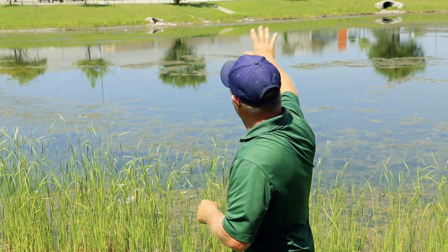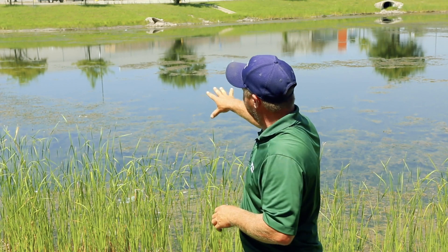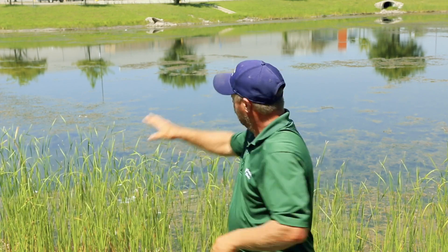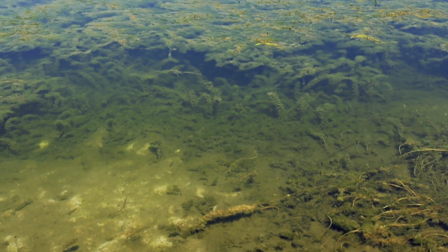Today we're at the PTI farm and we're irrigating some of our crops here at the research farm. One of the things we're doing is we're using Netafim drip tape, but our water source is a reservoir. This is one of two reservoirs we're using on the farm — an additional reservoir we're pulling water from — and one of the issues we've got is water quality. We've got a problem with algae and what I call seaweed growing from the bottom. We're getting too much sunlight in, getting some growth in the water, and we're trying to pump water out into our drip tape, which has small emitters. It's very important we keep the water clean and we're just having a heck of a time with our current filtration system.